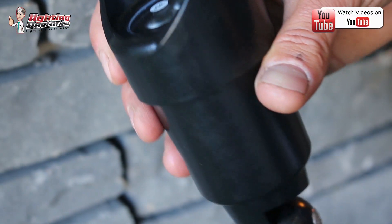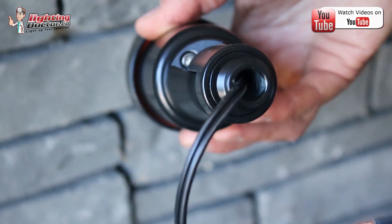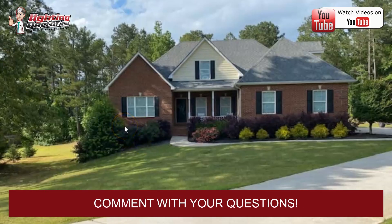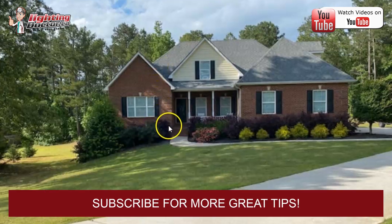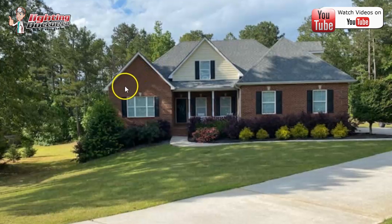Really all I'm doing is just using a standard up light like this — it's the most cost-effective way of doing that. I would have it just underneath the shutters, close to the house. That's the biggest mistake most people make: they'll put those lights way back and try to shine them at the house, which creates a very flat light and doesn't bring out the subtleties in the brick. If you can get it closer — call it 12 to 18 inches back — and have it shine more upright, you're going to really bring out the subtleties in that brickwork as well as get light up to that second story and really create a nice house lighting effect.